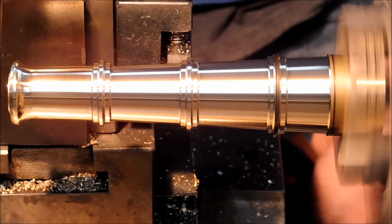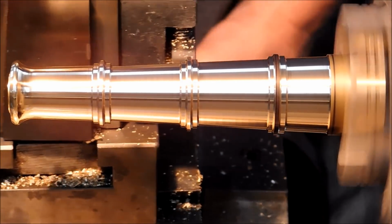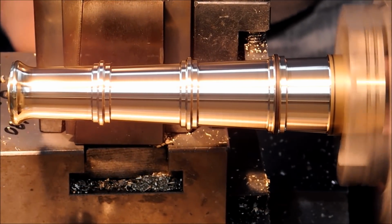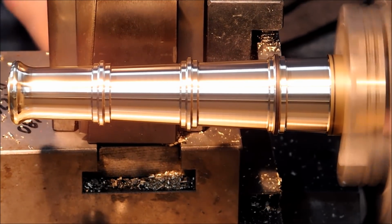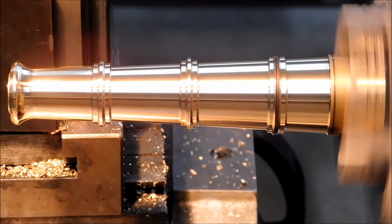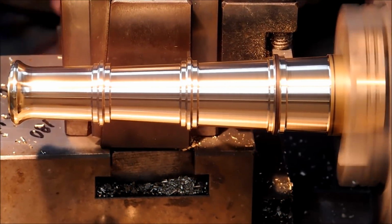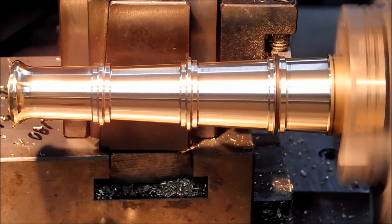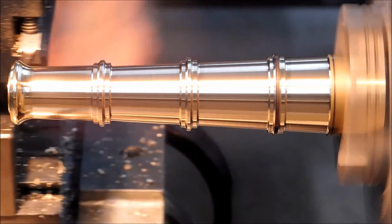This is a 45 degree tool. I'm breaking the sharp edges on the lower parts, and I'm adding not a generous chamfer, but a reasonable chamfer to the top of the raised part. And for this, I am using the carriage. It's just a lot quicker to get between locations. High-speed tool. And now I will reduce the larger section of this element to allow it to look more like the first one.